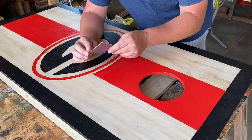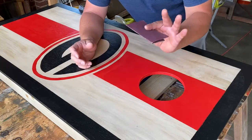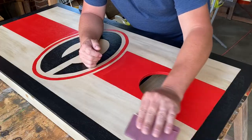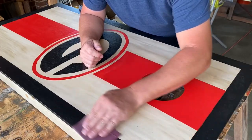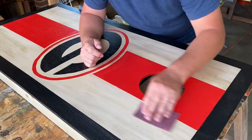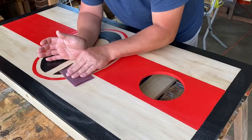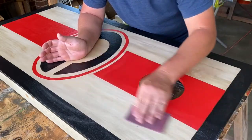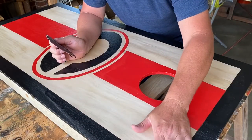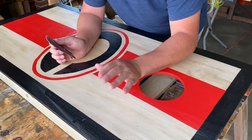I've got a half sheet of 220 grit sandpaper, folding it up twice. And now I'm very lightly just going to go with the grain in small sections, just like this. Let's just work on this little section of the board right here. And I can already feel all the little transitions between the painted area and the rest that were left — it's gone.